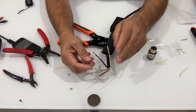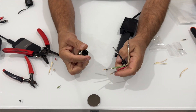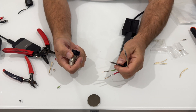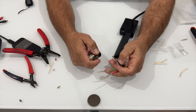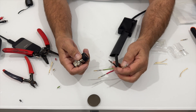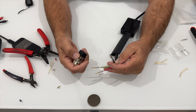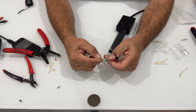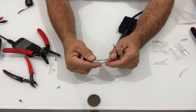I like to get my pin positioning done first. I verified I put my shrink tubing on. These are my power pins — black is pin 1 and white is pin 3. Black is actually your plus 12 volts, white is your ground. This follows house wiring standards rather than automotive — we've been making these for 14 years, and an engineer went rogue and decided to follow house wiring standards. We've got thousands of these out there so we never changed it. Black is plus 12 and white is your ground. When it comes to the signals, these are your two CAN lines — green goes to A and red goes to B.